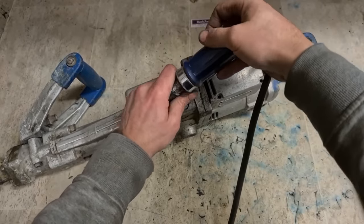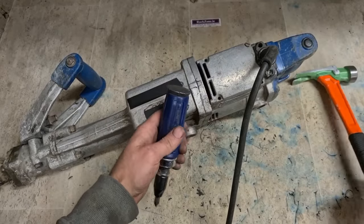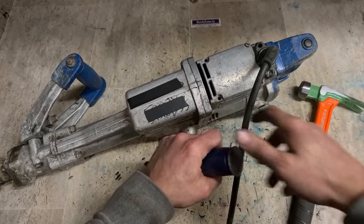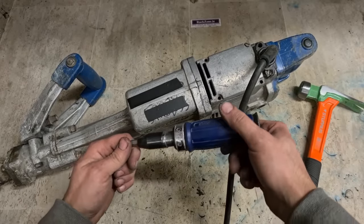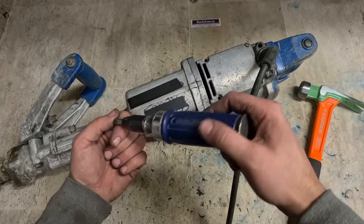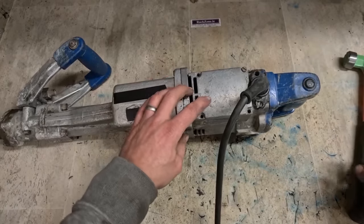As you slap the top of it, it actually turns the bottom. So as you're hitting it with a hammer, you're actually driving it into the head of the screw. And as it's driving in, it's turning, so no chance of it slipping out. But if they're dead tight, they'll eventually just tear it apart anyway. But good last resort before getting the drill out.